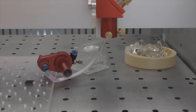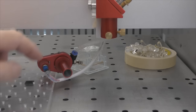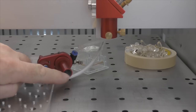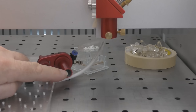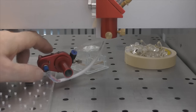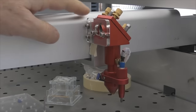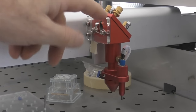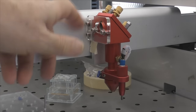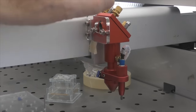One of the first problems we had to deal with was the fact that this machine, although it was designed as a 60 watt machine, has got a 100 watt tube in it. Down here we had a bore which was only 9 millimetres diameter, but the beam was about 10 or 11 millimetres diameter. So the first thing we had to do was to modify that bore. The second thing was to modify the head with an adjustable plate that allows the head to move in, out, and up and down.